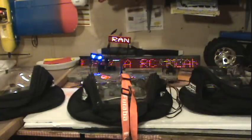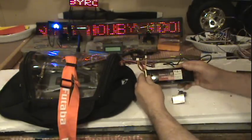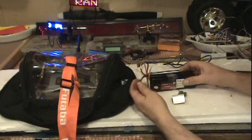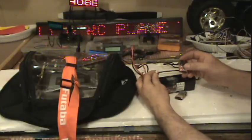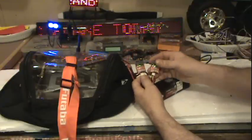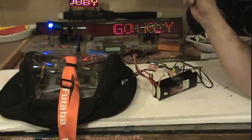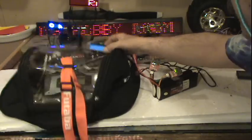Okay, so let's go over how we'll do this. You can use any battery you want, I guess. 7.2 volt, 7.4, or 11.1. So 2 or 3 cell. What I have here are two older 4,000 milliamp 2 cells. We want to make sure that we don't hurt the battery, so what we put on are 2 of these. They're really cheap to buy. You have to use these if you're going to use your LiPo batteries for a heater. Now my thermostat is taped right in behind the 2 pads there for the heating.